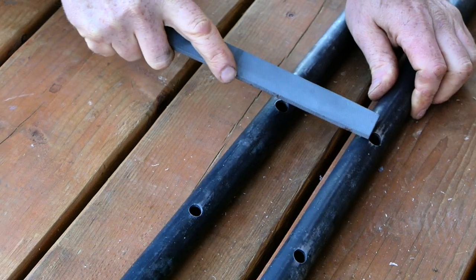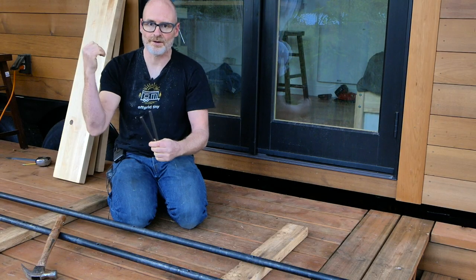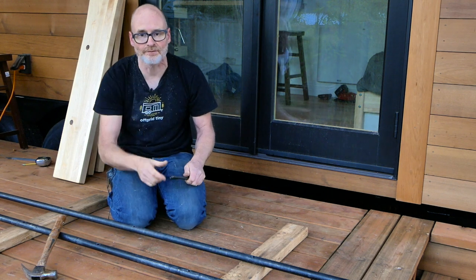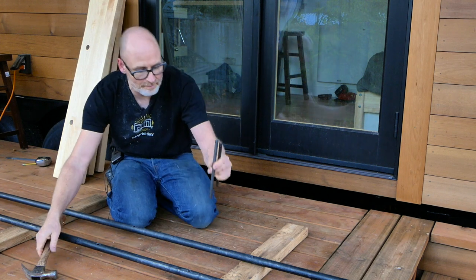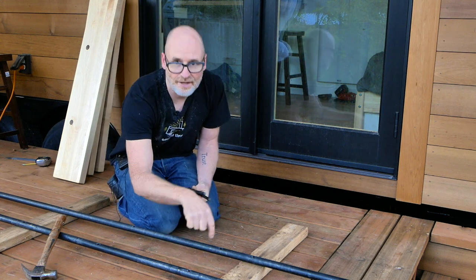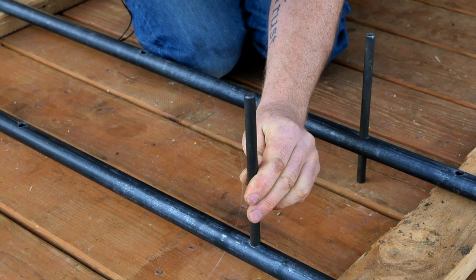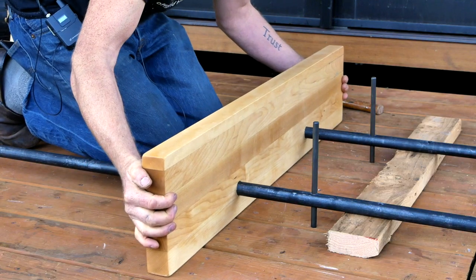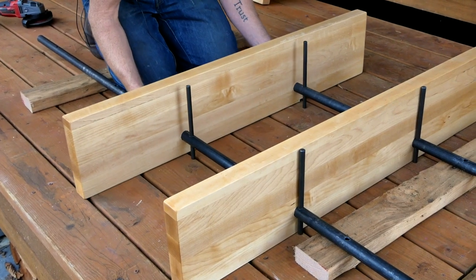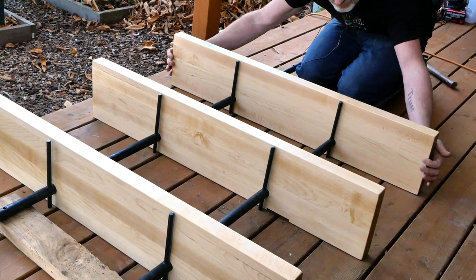Once I'm done drilling I take a minute to clean up any sharp edges with a file. Now we're ready for assembly. I've got my pipe, pins, and shelves — since the shelves will stand an inch and a half off the wall, I've supported the two pipes on some two-by-fours. Now I just take my pins and pound them through, and as soon as they're touching the floor I know they're spaced correctly. Always pound in the pins at the bottom first, then slide the shelf down over them. I pound in the bottom shelf pins, slide the first shelf into place, pound the second set of pins, slide the second shelf in, pound the last set of pins, slide on the last shelf, and we're ready for install.